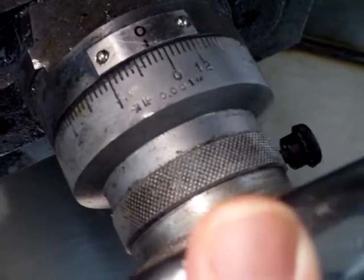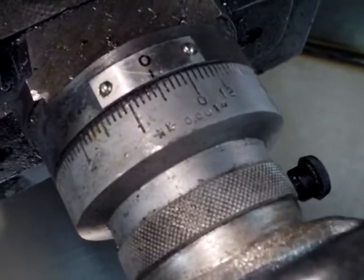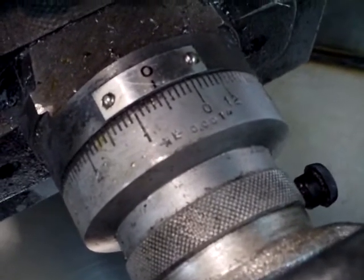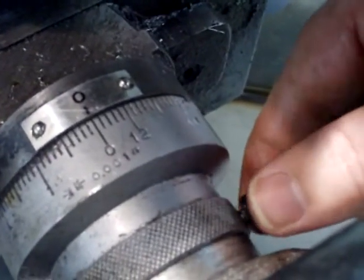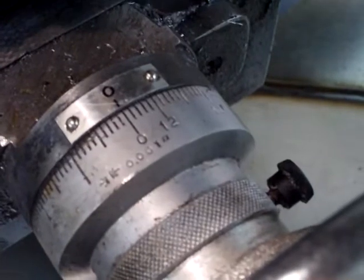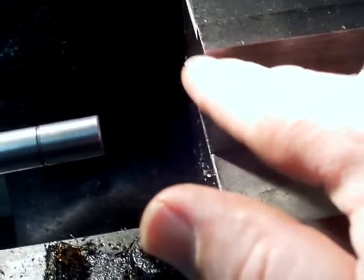Whichever way we want to go, we need to move it when it's clamped and take the backlash out. The backlash on this mill is 5 thousandths on the y, and I'm just putting a little bit of pressure on it — maybe 5 and a half thousandths. We go under the table with our hand and unclamp it. We're going to put this on zero, because we're taking 5 thousandths out. You can do this without all the clamping if you know what your backlash is, but I check my backlash every time. So if I turn it back around to zero, now I know I'm on zero, zero — x and y axis, which is the exact corner of the vise.